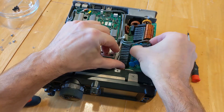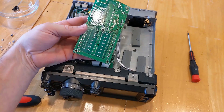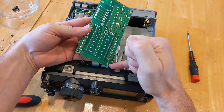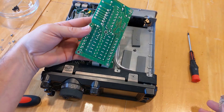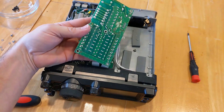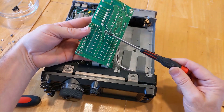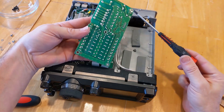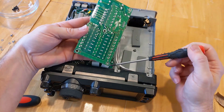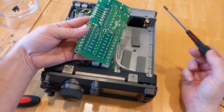There are five screws, and we're going to pull all those screws out and lift the antenna tuner out. With all five screws out, we gently remove it — keep in mind there are some sticky pads in there. Now, on your Yaesu 991 and even the DX10, you'll notice that all of these grounding points have PCB lacquer all over them. What I want you to do is gently — and not over the radio — sand each one of these little grounding points until they shine a bit. You can take some acetone and rub it off just to clean it up. We need to get a better ground to the chassis here, and I have no idea why Yaesu Production covered each one of these points with lacquer.